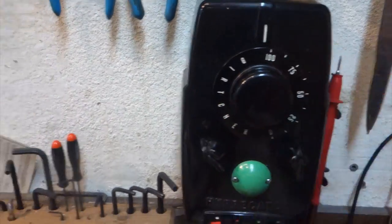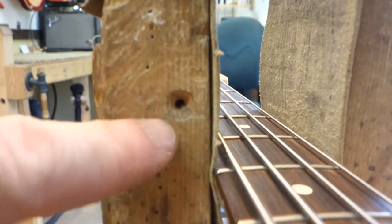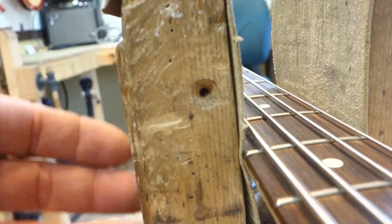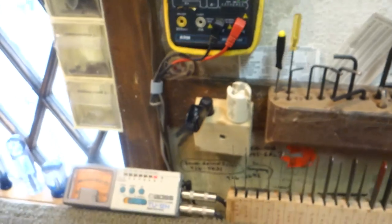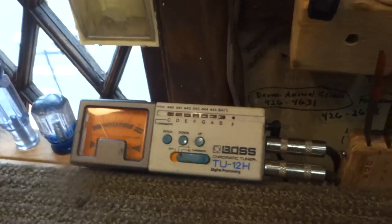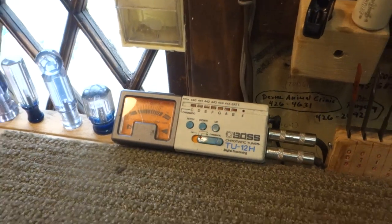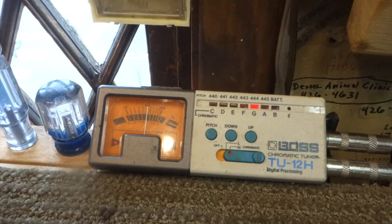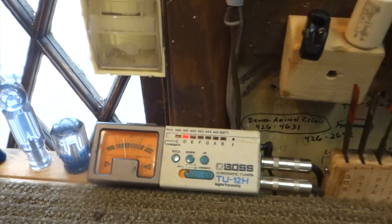Starting in the first position: over here in my vise, inside this hole, there's a small condenser microphone, and built into this half of the vise there's actually a transducer film. So in the first position it will turn on the tuner and pick up audio signals through the microphone section. For things that aren't quite loud enough, it'll also pick up the vibrations directly from the neck as they're in contact with the vise.